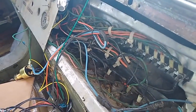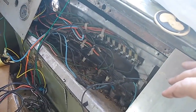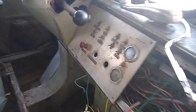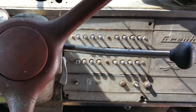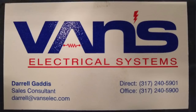This is not a very complicated bus. You probably don't have more than 15 to 20 different leads, and just whoever did this — I don't know what they were doing. Pulling this all apart and fixing it is going to require some detective work. I've got the schematics and we've pretty much figured out what needs to get done. Now I want to rebuild it. Right now they use toggle switches, but originally they used push buttons — momentary switches. I went to an electronics place today and sourced a switch manufacturer for that.